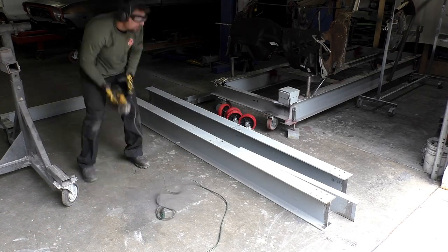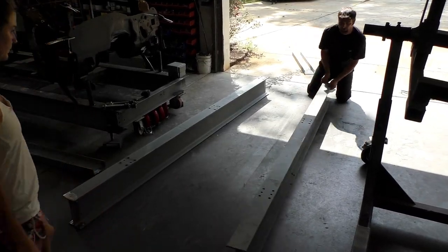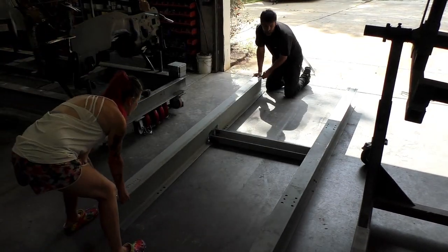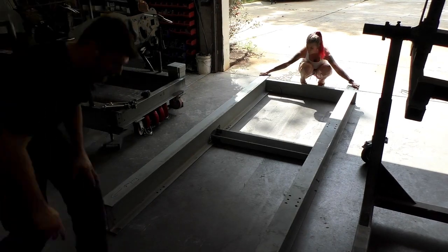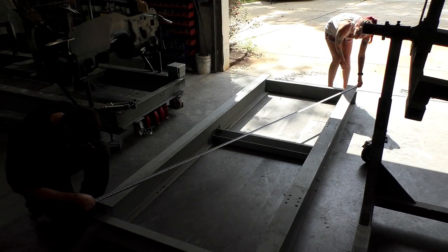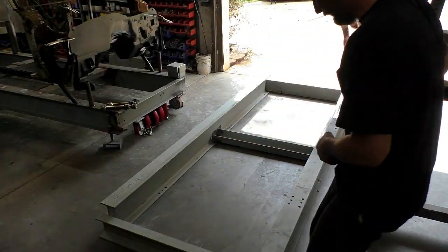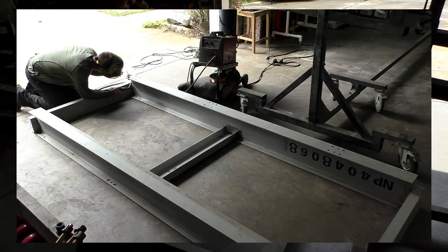I also removed all the paint that came on the I-beams and the rest of the metal - everything here is protected, it's not in bare metal. If you're going to buy this metal brand new, you should spend the money and get it painted and protected so it doesn't rust on you in the future. We're using the flat level of the garage floor and laying this whole frame fixture out. You could add more supports in the middle - on our other frame fixture we have four beams total, but we actually ran out of metal, so this one's going to be only three.